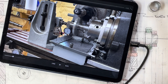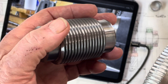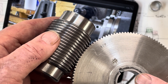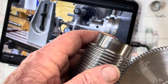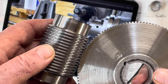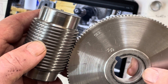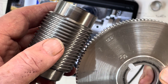All you're doing is generating the lead angle for a relatively narrow gear, so it's going to see relatively few rotations. I cut this worm gear on my lathe - it's a Mod 1 worm gear. My lathe is set up so I can just make a minor tweak to the change gears and produce this screw. If I were making a hob, I'd cut the same thread and do the cutting details afterwards. I'm just going to make sure everything is properly supported in line, and for lubrication I'll just smear a bunch of grease on it.